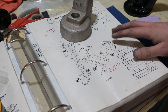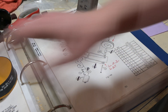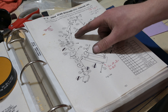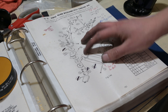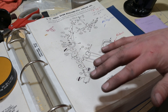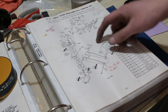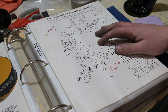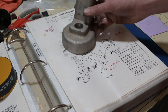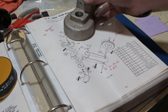This nose gear is just going to be temporary. This early design with the little donut things is horrible. Later on there was an option to upgrade to the Outback gear, which is an actual proper oleo strut used on the 320s and up. I'm going to do that, but it's impossible to find those unless you can find a wrecked plane — and as soon as you do, you call them up and the Outback gear is gone. So I'm still going to roll forward with this gear and just try to make it work, even though I know it's going to be really stiff.